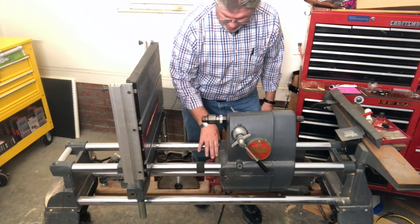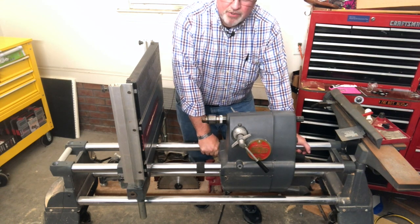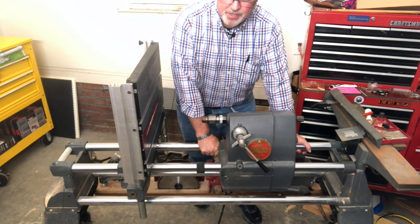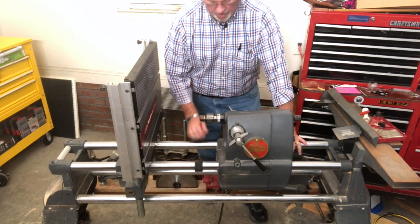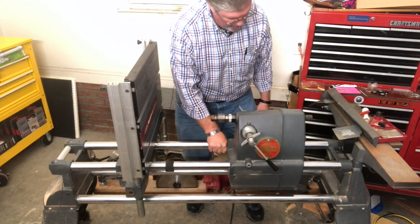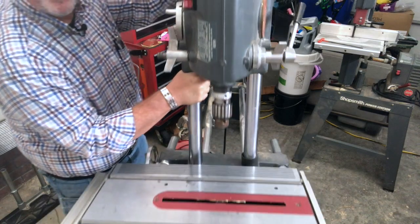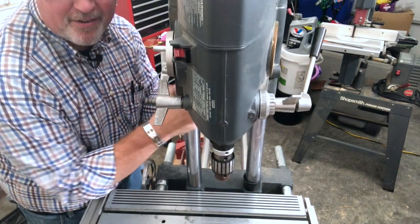Always grab this tube directly under the headstock and grip the tube as you lift. One of these days you're going to accidentally begin to lift and not realize that you haven't locked the headstock. So this grip will keep that headstock from sliding. Let me demonstrate this. I'm going to loosen the headstock — okay, so that is loose as can be. Gripping here and beginning to lift, I'm using my left hand on the top of the headstock on the tube, my right hand here. I'm going to begin to lift. Oh, that headstock is loose. So I'm still gripping with my right hand. Notice if I support the weight there, I can move it.